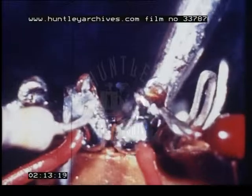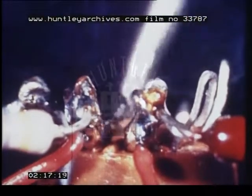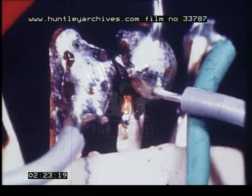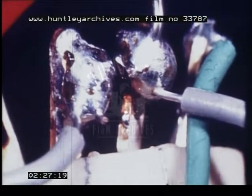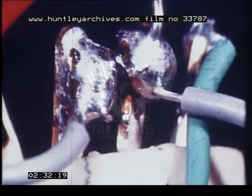This fault can be remedied with the soldering iron. Here as well, too much solder has been used and a short circuit could eventually occur. In soldering, the expression 'the more the better' definitely does not apply.